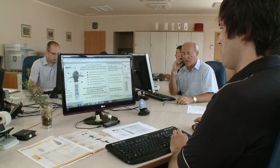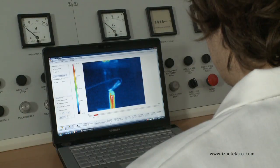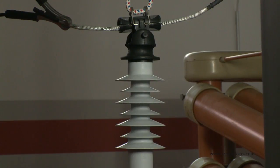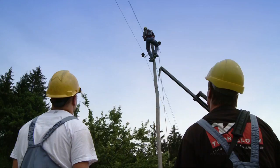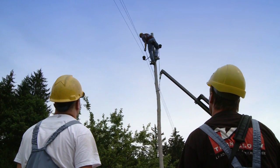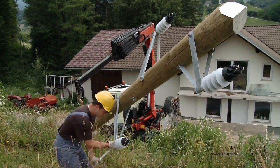Various studies, lab research and measurements performed on power lines have demonstrated that excessive electric field strength and the resulting partial discharges are likely to occur at a conductor's fastening point onto an insulator with metal end fittings. This may lead to the conductor burning off from its place of fixation after long-term use.